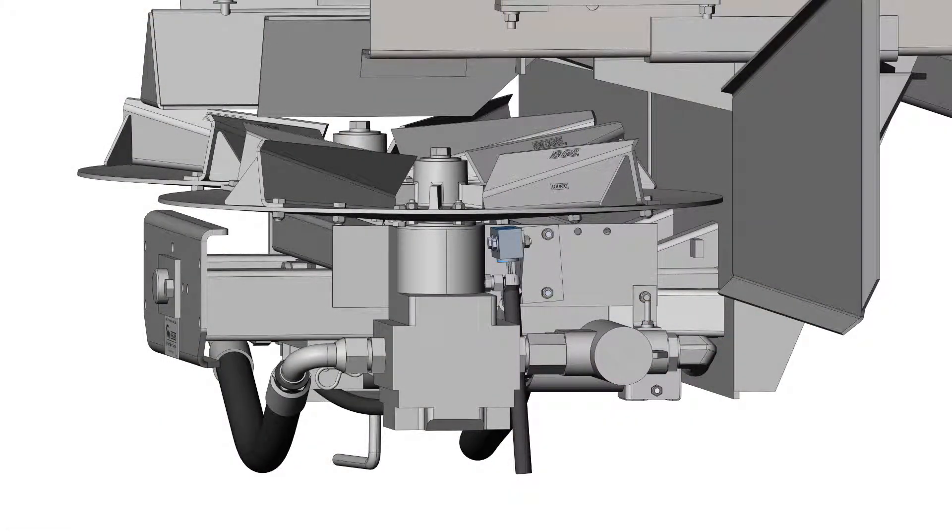If there were no changes in spinner speed and the motor that was running slower is still running slower, then the 50-50 valve is operating correctly. The problem is with the slower spinner motor and it must be replaced.